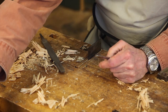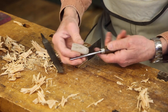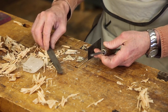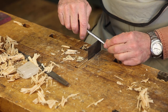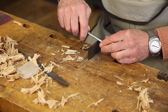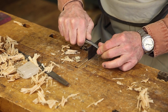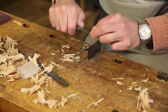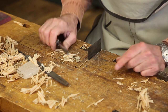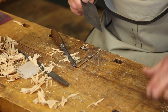I now take a device called the burnisher, which is really just a very hard piece of steel — like a file with no teeth in it. I'm going to hold it at roughly the opposite angle to what I filed at, and applying a good deal of downward pressure, I have just rolled a very heavy burr along that edge. I can definitely feel it with my finger.